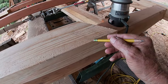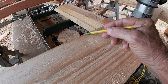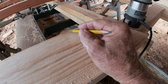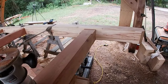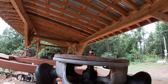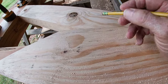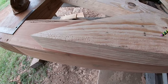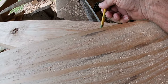I've got one more detail to do before I buckle it in there. I've got a mark here that is four inches down from that point and a mark here that's four inches down from that point. I'm going to take my router and put a little chamfer — it won't be as big a chamfer as what's on the edges of the post or on the top plate. I've set my bit a little bit lower on the router since it is a smaller timber, to keep things in proportion. Then I'm going to take the sander and give this a good cleaning up on all three sides.